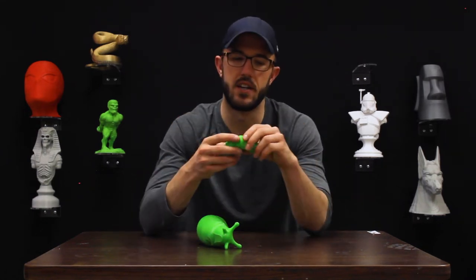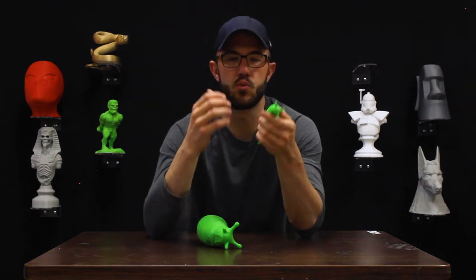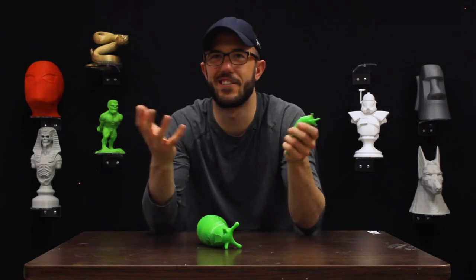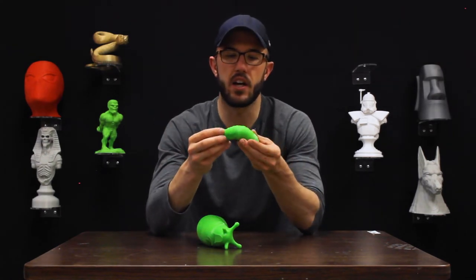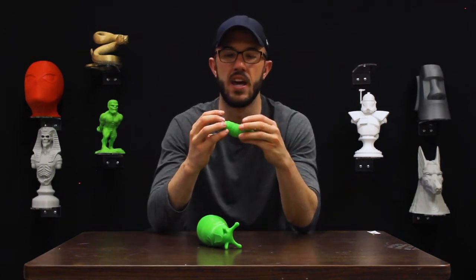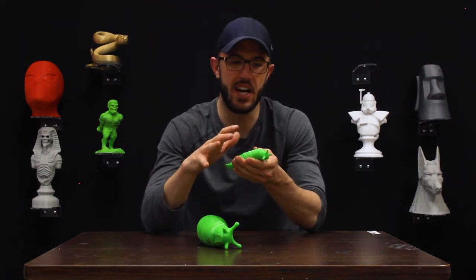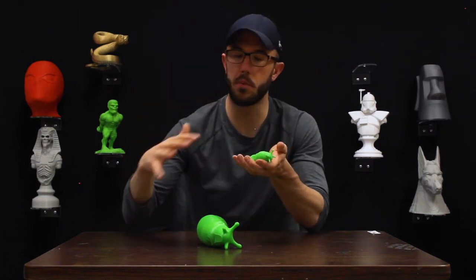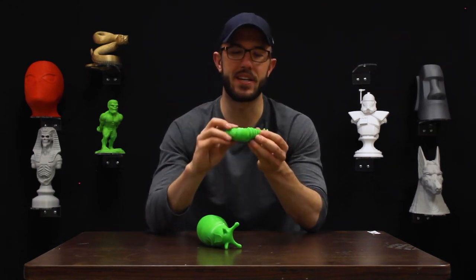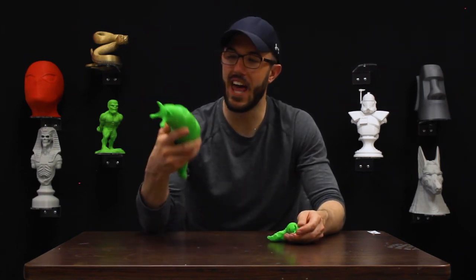The reason this slug is an awesome design is because of the flexibility. From a 3D printing standpoint, it's really hard to make multiple parts work well together. This slug comes off the machine fully complete, shaking and wiggling just the way it is — right off the machine. The design has no overhangs that warp or need support, so there's no post-processing, and the hinge mechanism allows basically three dimensions of flexibility at any size and is reliable.